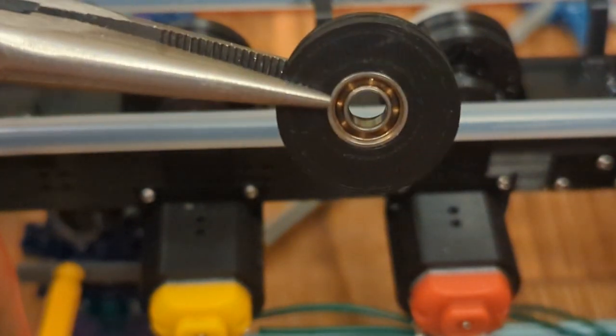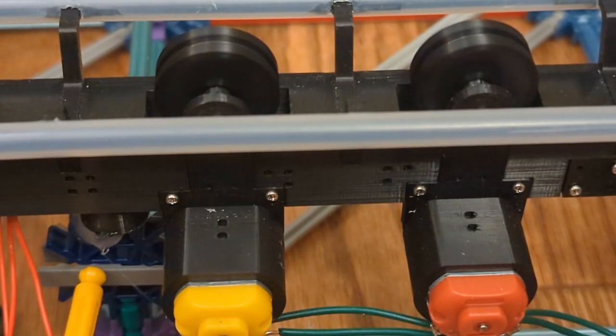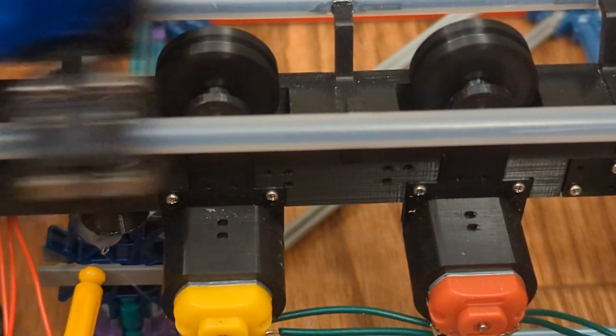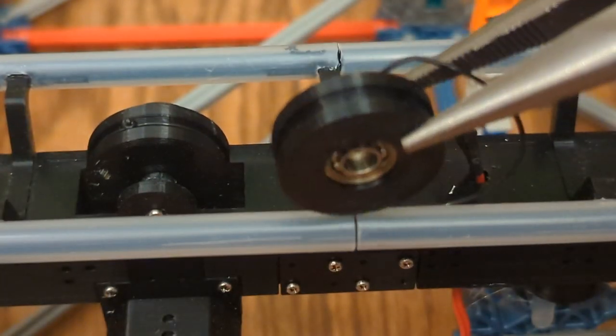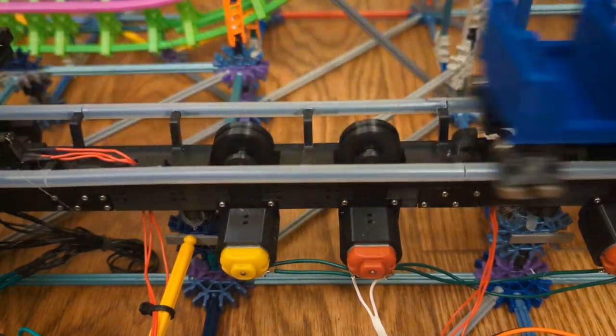The wheels and the track were the final mechanical challenge I had to overcome, but it was something I pushed way too far back. Below each wheel sits a brushed DC motor with a small pulley attached to it. This pulley drives a belt wrapped around the center of the wheel. I reused a worn train bearing in the center of the wheel to provide a reduced friction spot for them to rotate on.